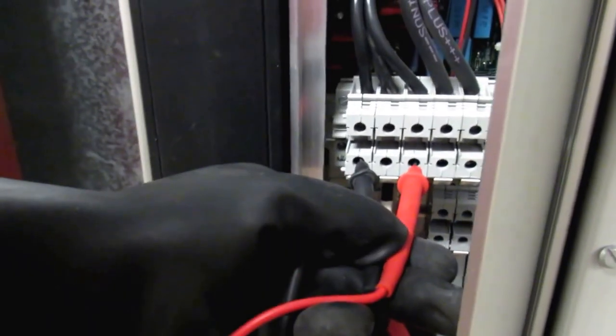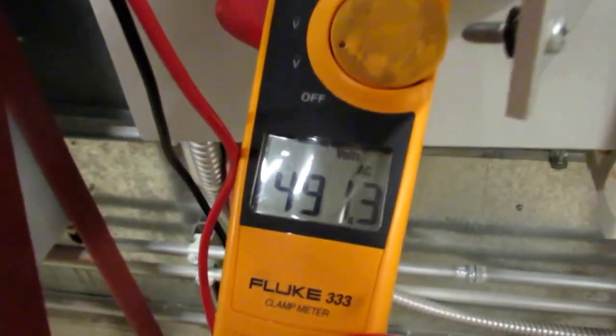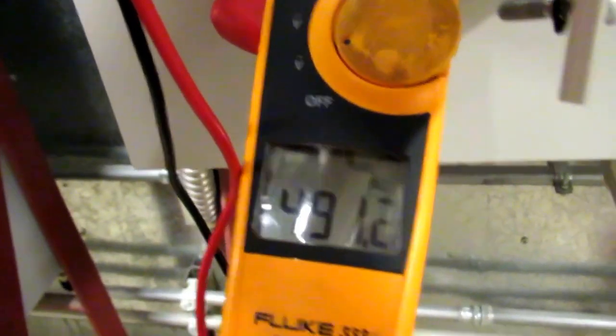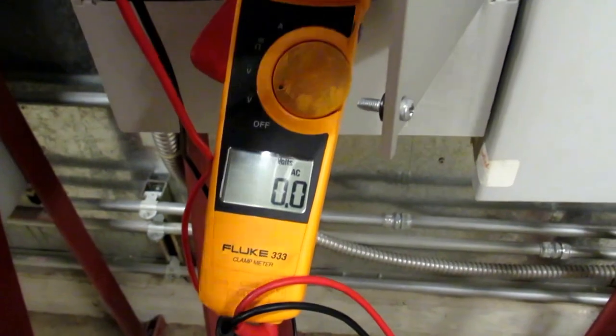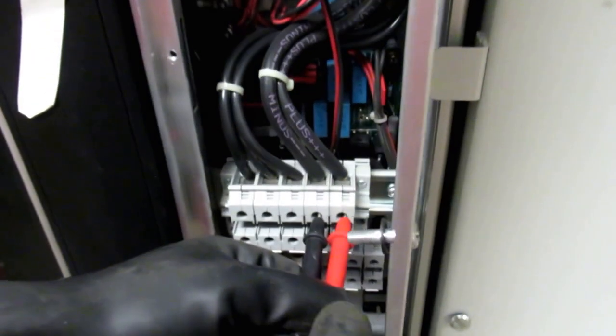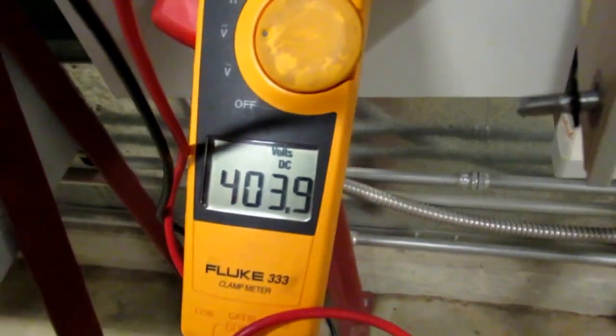It's important to remember that just because you have a piece of equipment locked and tagged out, there are still potential dangers within that system. Different types of motor controls, VFDs and that sort of thing, have large capacitors that can store a significant charge even after the power is disconnected. Here we have the meter landed on the incoming power to this VFD, showing approximately 491 volts. When the disconnect is shut off, the incoming power falls to zero. However, when we measure the bus voltage of this drive, the capacitors are still storing a significant amount of voltage. Even though it is DC voltage, it is still very dangerous.